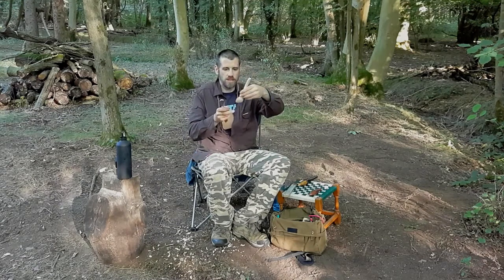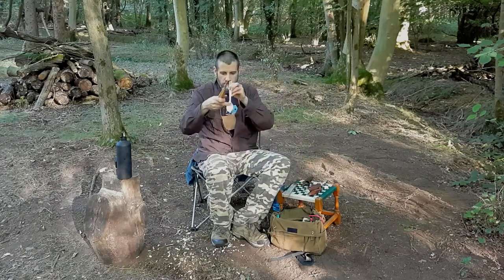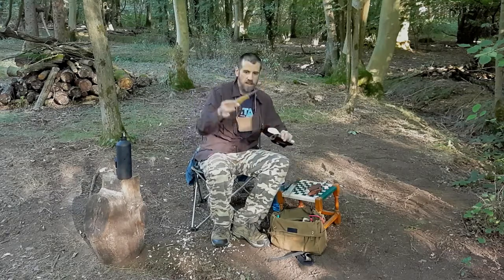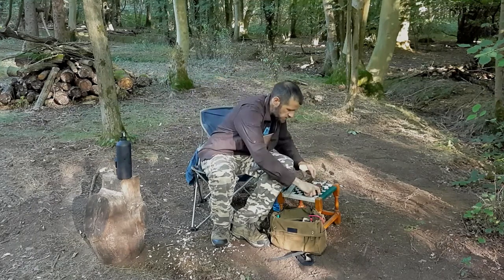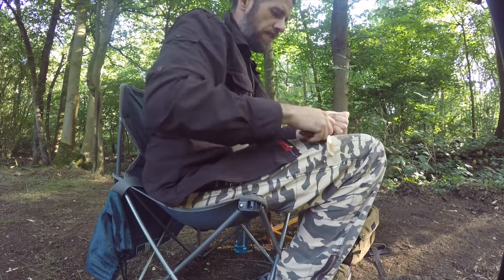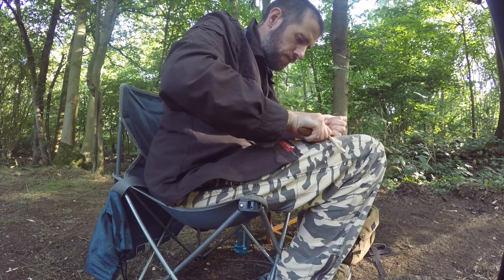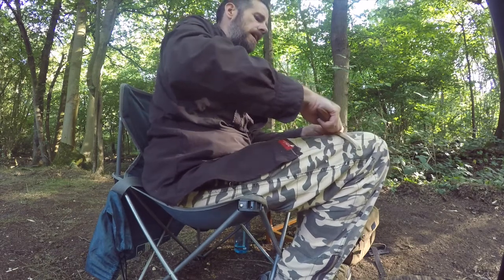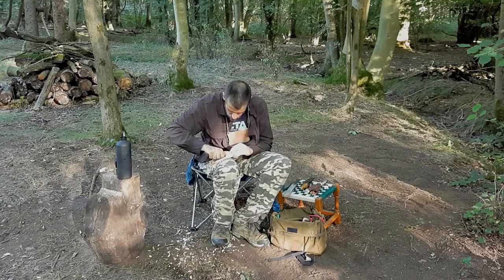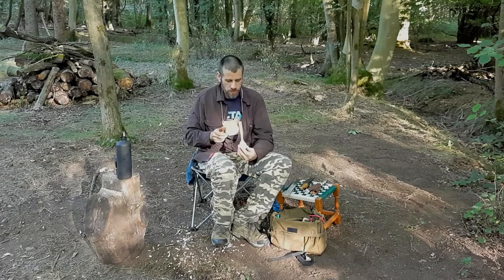This side's looking pretty good — just a little blending cut coming this way. Again, just keeping the knuckles on the leg and making sure they don't lift up or put any force coming back this way, other than the rotation of the tool. Just gently manipulating the billet so that you cut where you want to. That's looking quite nice on the inside now. It's created a tiny bit of a furry edge just here, so I'm going to come at this again with a straight knife. It's a long blade and I only really want to work with the tip of it, so I've got the same sort of thing but a much shorter version. I can now come around here and use the tip just to come in and take those off, which works quite nicely.